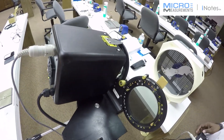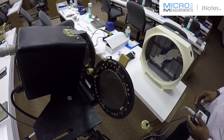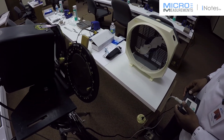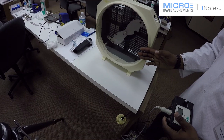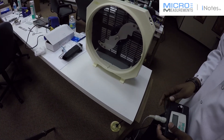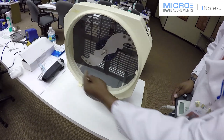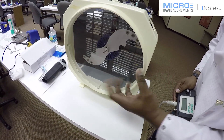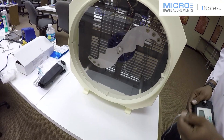In this particular demo, I'm going to show you what it looks like to take the photostress system and apply a stroboscopic light source to it and allow us to see the full field behavior of stresses happening on a fan blade. We've made a simple fan blade, and on the ends of the blades we've actually added weights.